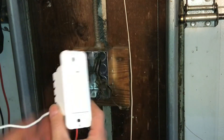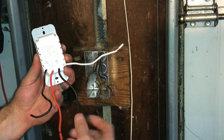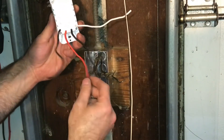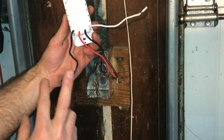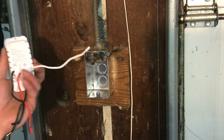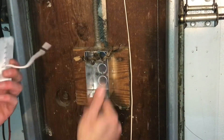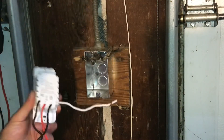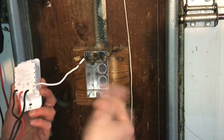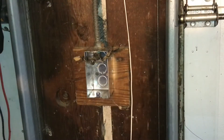Here's the three-way smart switch. It has a plastic body so there's no ground directly attached to it, and the wires are clearly labeled. We have our 'line,' which goes to the power, and then we have our travelers - I'll put red to red and black to black, though it actually doesn't matter since they just toggle back and forth. Then there's a neutral wire terminal. There's no neutral wire in this box - in Romex cable you'd see them tied together in here, as they have nothing to do with the switch. I'm guessing they tied the neutral in the other switch's box and didn't run copper wire all the way down here.